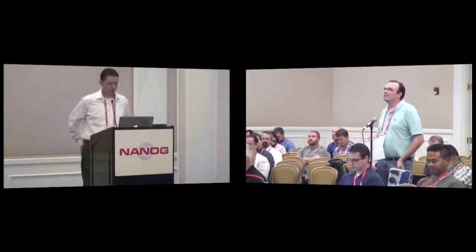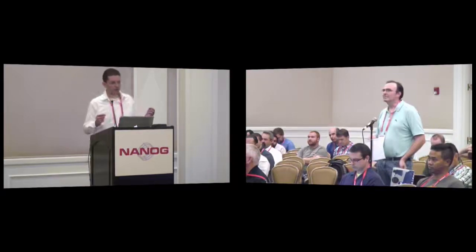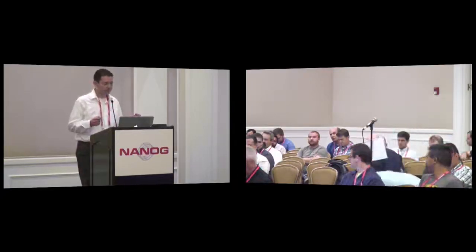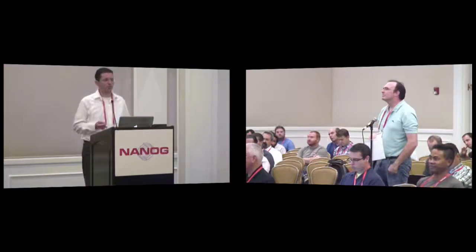No, so all the ports that pop out of the patch panels, those are going to be all the female sides. All the cables themselves have the male end. So you can flip on either side, right? But if you flip just once, in this case on the MTP trunk, then you don't have to worry about where else to flip. So that makes the breakouts a lot easier.